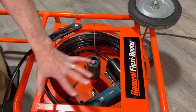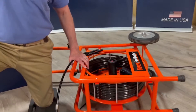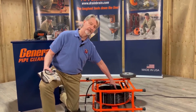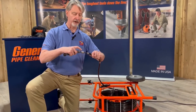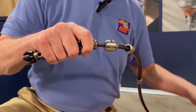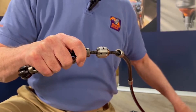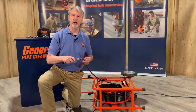If you need to take the flexible shaft all the way out of the reel to lubricate it or do some repairs, all you do is take the plastic cover off the flexible shaft. You'll notice there is a flexible shaft coupler identical to this one on the front end of the slip clutch — just loosen that. Everything else is logical. The flexible shaft can come out of the reel very easily to allow whatever work needs to be done.